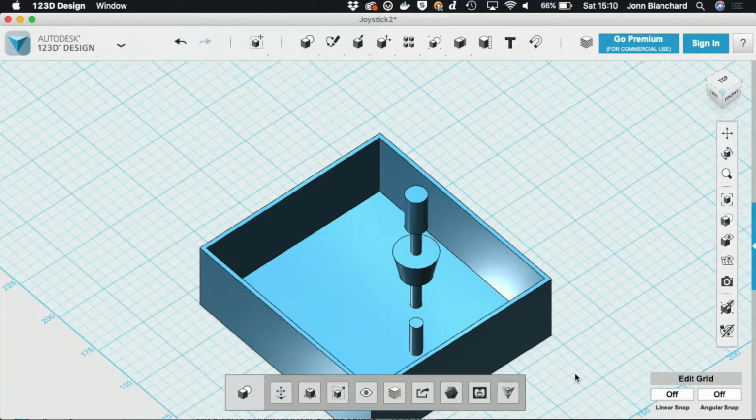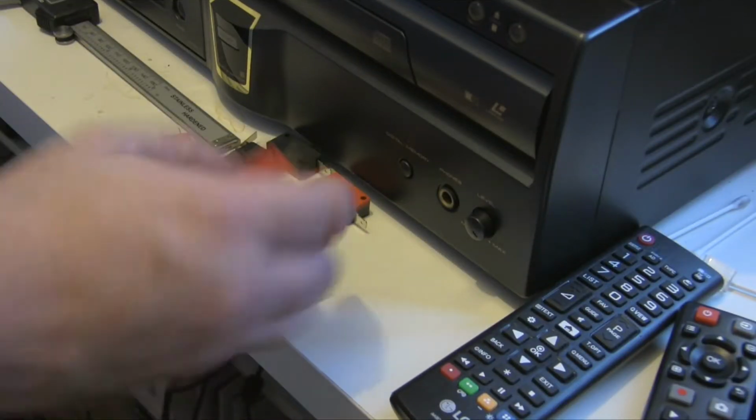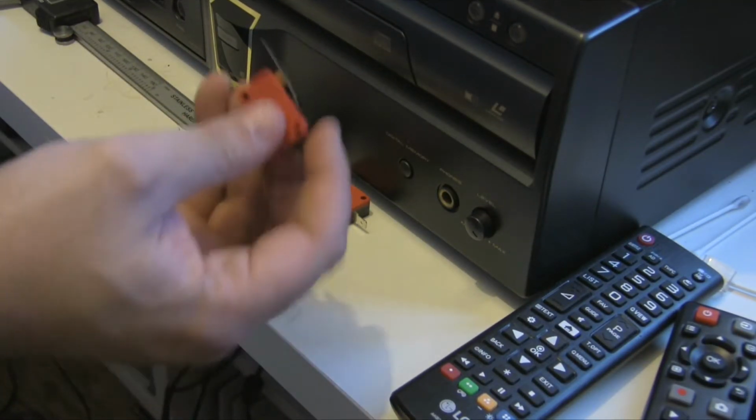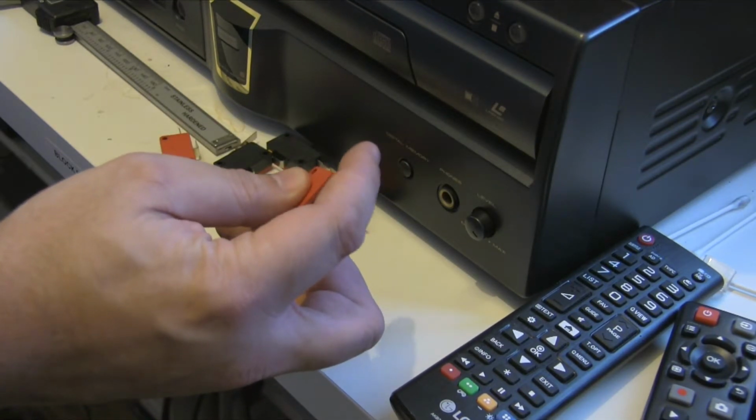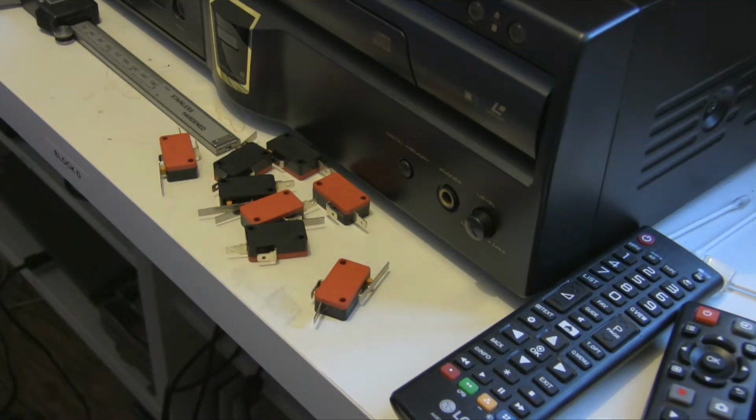The micro switches, like I said, I just took apart a joystick, in fact 2 joysticks, to get them. They're just micro switches. Really just find nice ones. I mean, this kind of design is, I feel, the best one, because this long latch here means that you can overlap the latches a little bit, which makes it easier to get the joystick doing the corners correctly. So, anyway, this is only a short one. This is just a short extra part to the build a joystick thing. We'll get into more next time.